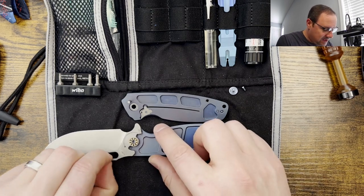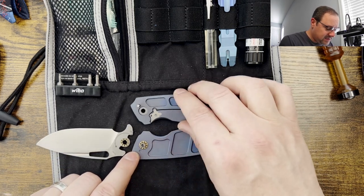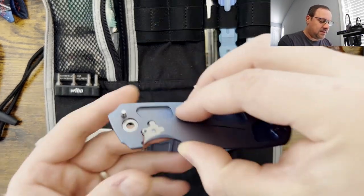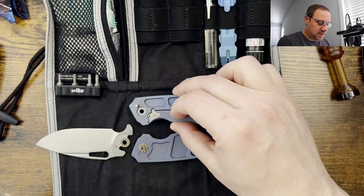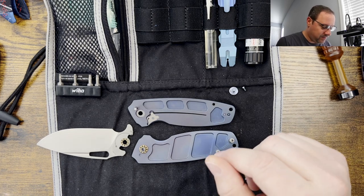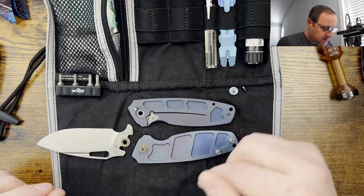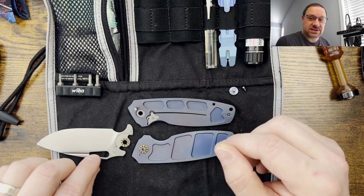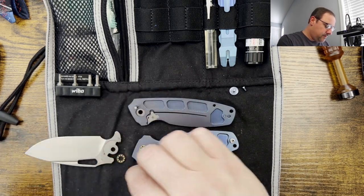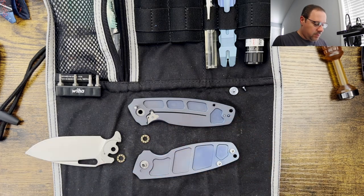You've got ceramic balls here. Make note that the closed side is facing the blade, and it's housed down into the scale — it has a little bit of a lip there, and the reason I point that out is it's going to help prevent debris from getting down in there. At this point you can clean it up, clean up your bearings. I actually checked all of this when I initially got it — I just took it apart, cleaned it, and reassembled it. Since we have it apart, I'm going to give it another quick clean and we'll be right back.